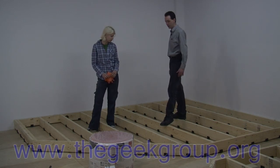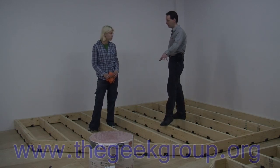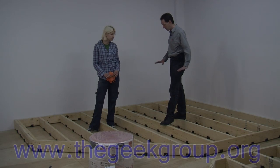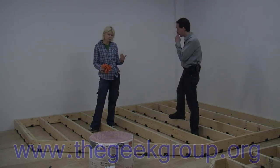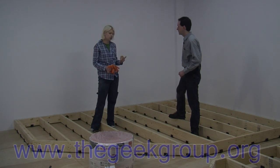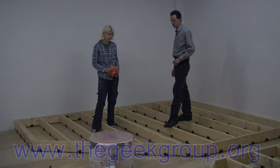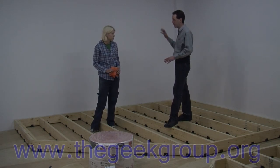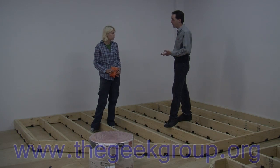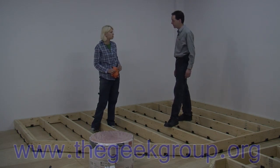Yes, I am. Okay, so we've got R30, which is the highest R value insulation we could get. It's designed for a thick space. I think it says 9-inch space. 9 inches. It's intended to go into your attic. Which was really the only choice for the R30. Yeah, there's a lot of R13 choices, and we didn't want that. We want the high R. We were shooting for a 34 or something like that, but they didn't have any. So we could only do higher than 30 if we decided to go with blown-in insulation.